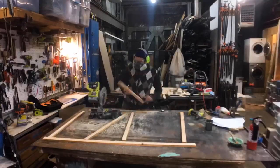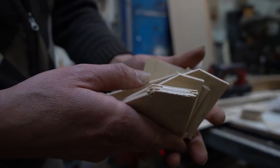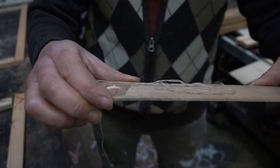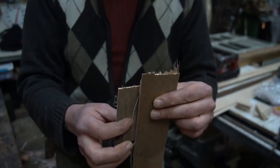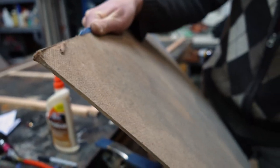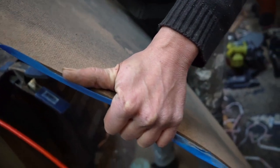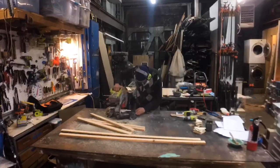After you have laid out the pieces, you need to join them together. I am using 1/8 inch Baltic ply, which I suggest. Do not use Luan. I tried using Luan, but it was too brittle and broke when I flipped over larger frames. If you don't have easy access to 1/8 inch Baltic ply, Masonite, also called hardboard, is a great substitute and readily available. I cut a length of it at 3.5 inches wide, then I cut triangles out of it.